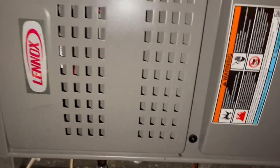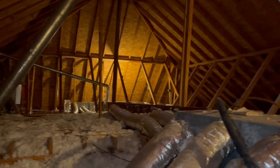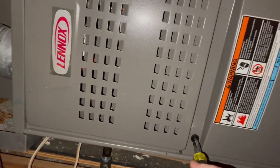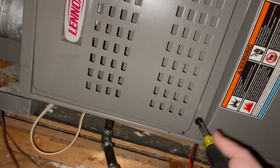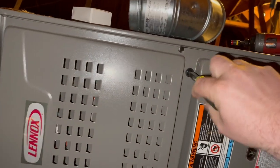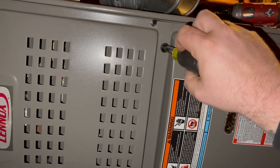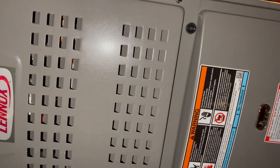So it's a couple days later, and y'all remember that B-vent I showed y'all on that furnace down there. This is the four-ton system. This one has a weak blower capacitor. I'm almost positive it's a 7.5 — that's what I brought up here, so I hope that's what it is. It was reading like four-something, so we're going to replace the capacitor on this one.